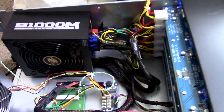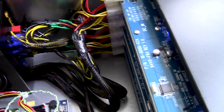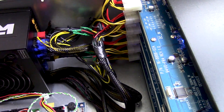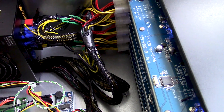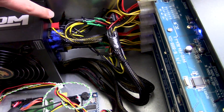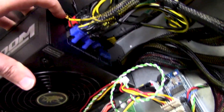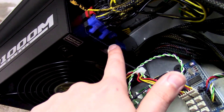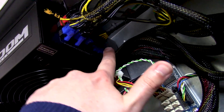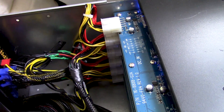Here's our glorious creation — we can see there's my thousand watt power supply and we've got the cables all plugged in. Some of the cables are a little short, so maybe if I optimize this in the future I'm going to lengthen some of the power cables. Mostly what's limiting me is the adapters for the five volts — this one is basically plugged in only so I can get the five volts out of there. That's true for all of the things I've plugged in here. All of my peripherals, my SATA hard drive connector type connections — these are all only used for their five volts, because the CPU or GPU adapters, they only put out 12 volts and grounds. And over here we can see these Molex connectors — the five by two — they're all plugged in.